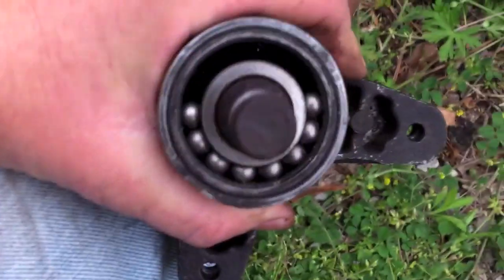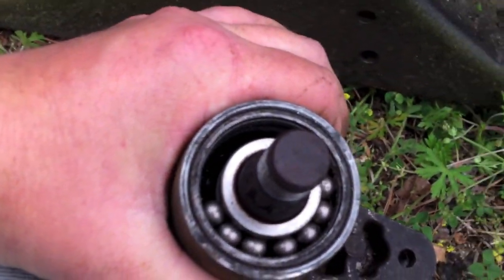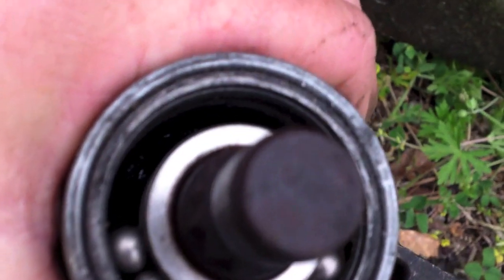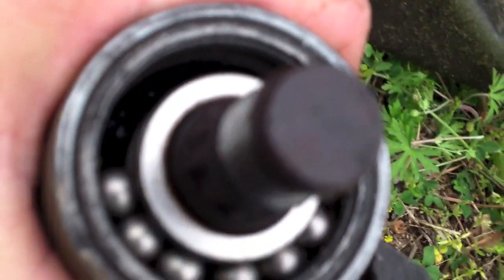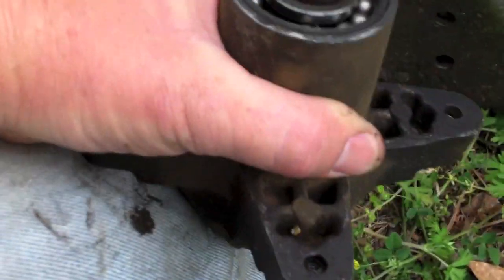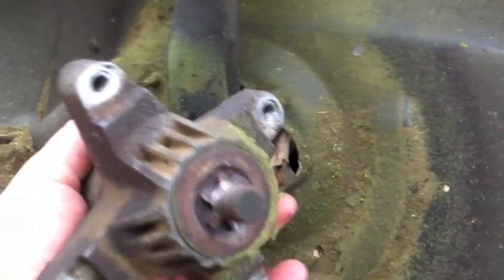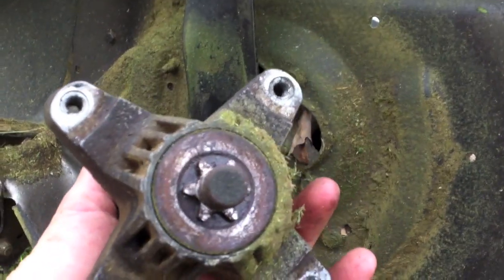We got this guy off. We are missing five or six ball bearings — it says ball bearings, not just roller elements, it's got ball bearings. You can kind of see a little bit of metal down in there, so they were eating out and this spindle just got worn out. It's a shame because I did not break any of the ears on this thing taking it out — that is crazy, normally I'll break two.